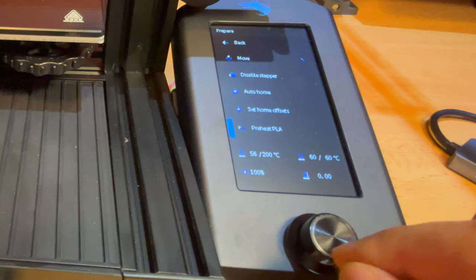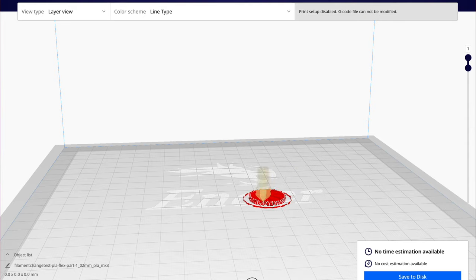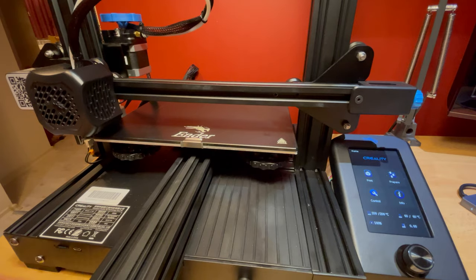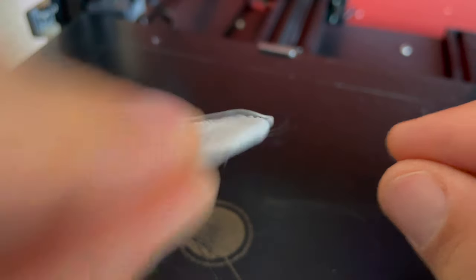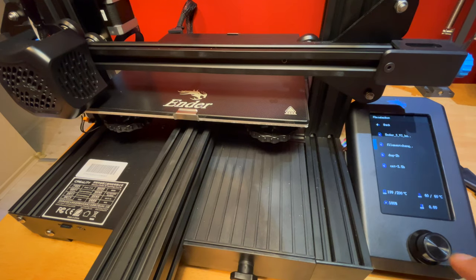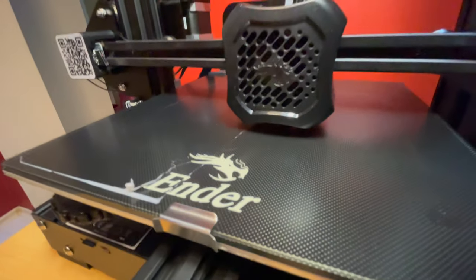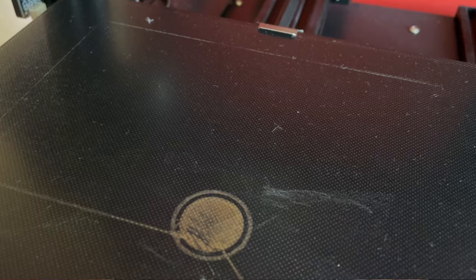I thought I was ready to print. I loaded the included filament by heating the nozzle up to 200 degrees and pushing the filament through the hole until I saw some fibers coming out of the nozzle. I found a simple 3D model online as a G-code file, placed it on the SD card, did the PLA preheat from the printer menu, and started printing. The end result was a failure — back to school, first grade. I leveled everything once more and started another print hoping this time everything would be fine. But it was not — far from fine. The filament was not coming out of the nozzle, the indication knob was cracking strangely, and it seems I somehow burned my bed. Not scratched, but on the places where the nozzle was, the bed is a different color now.